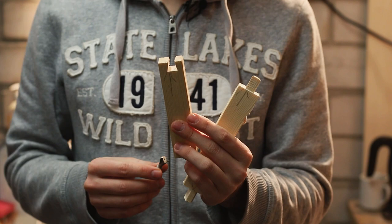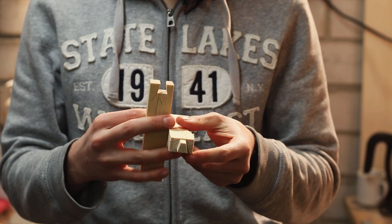We decided to use dovetail joints that I would mill into the ends of the wooden struts. I cut the female side of the dovetail joint with a special dovetail cutter, and the male side was done using the standard 6mm spiral cutter that is shipped with the Shaper Origin.